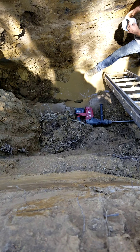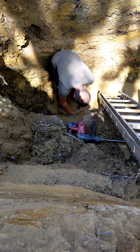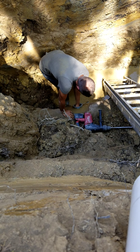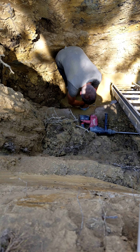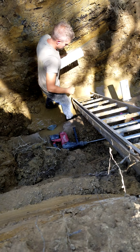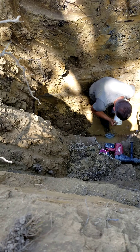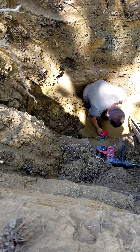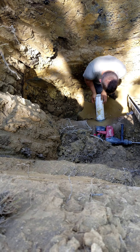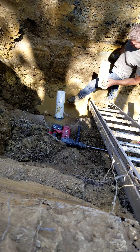Okay, we're gonna put that fitting in the hole, open it up. He's gonna take the soapy water that I made and lube the inside of that fitting, and then the pipe. I gave him the chamfered end going in first and put some soap in there. When you want something to go in real easy, you lube it up — plain soap, whatever you use.